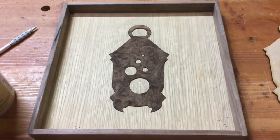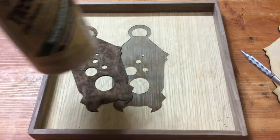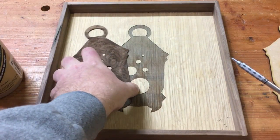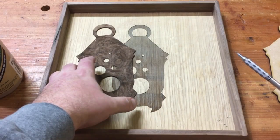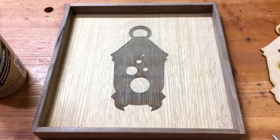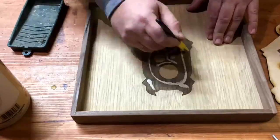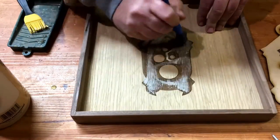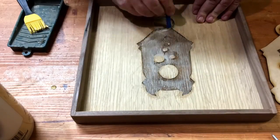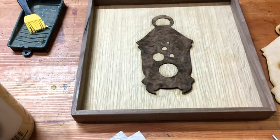The next steps are to remove our veneer. We'll use a little cold press glue, get that on there, put our veneer down, put some clamping pressure on it, and then come back tomorrow and see what it looks like. If you have means to spread this cold press glue mechanically, that's best, meaning you've got exactly even coating everywhere. It's a little bit finicky to get it exactly right — you need to have the same thickness all over, otherwise you'll be able to see it through your veneer. I got it pretty close here, but it could certainly be better.